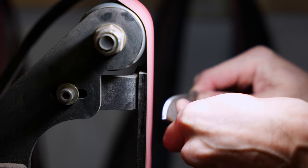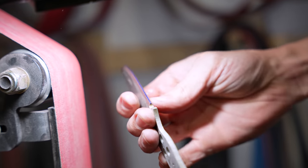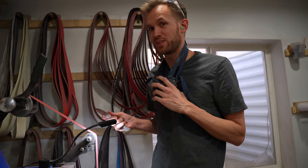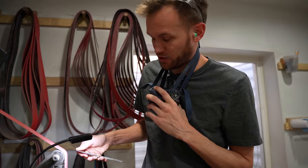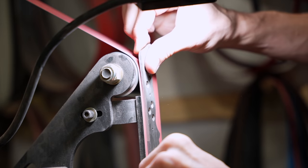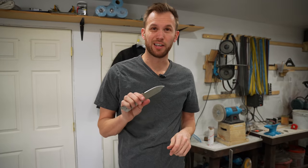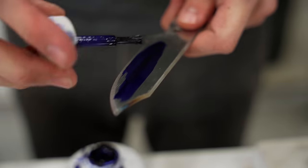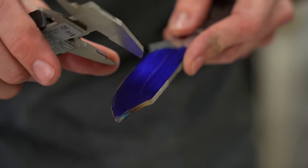I've broken the 90, and now what I have is a very thin line running down the center of the blade. It's far too thick to be a cutting edge — it's probably one to one and a half millimeters wide at this point — and I'm going to try and mostly leave it there for most of the knife grind. Now I need to bring that thin line back to the thickness I want for the whole blade. To give myself a consistent goal of where I'm trying to grind to on both sides, I'm going to use the same marking fluid and a set of calipers to scribe a line to aim for.